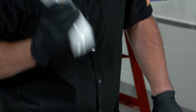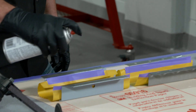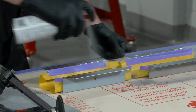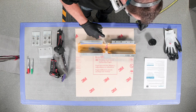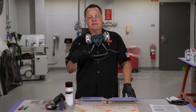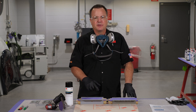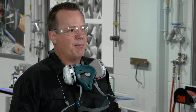I'm going to apply the first coat. I've applied my first coat. This product requires two light coats and five to ten minutes of flash time in between. Then it's a good idea to wait until it's dry to the touch before we start welding. So let's continue to walk through this process step by step.